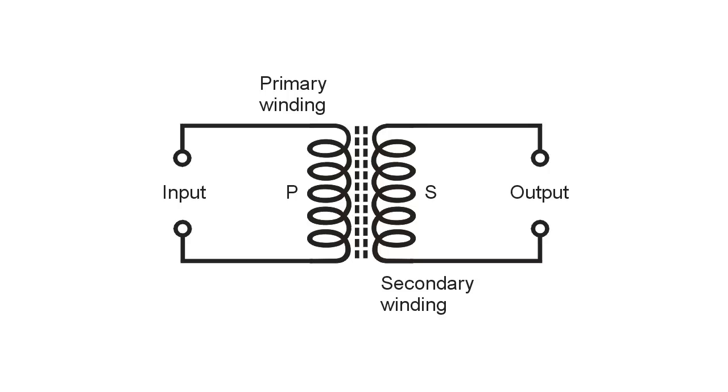I have created here a generic diagram of a transformer with a powdered iron core. You can tell it's a powdered iron core because of these two dashed lines between the turns. Dashed lines means a powdered iron core. If they were solid lines, they would be laminated iron. If there were no lines at all, it would be an air core coil.